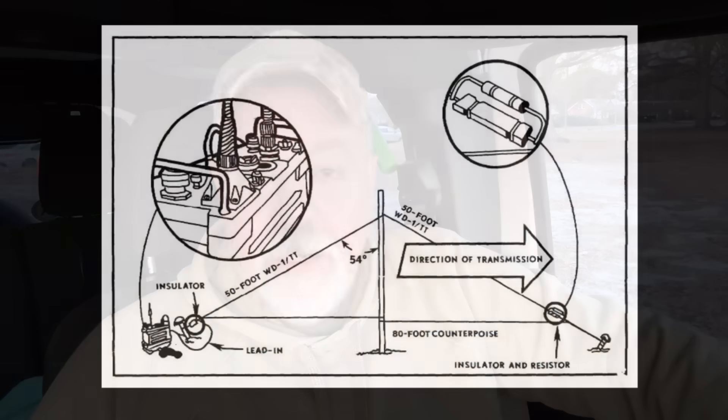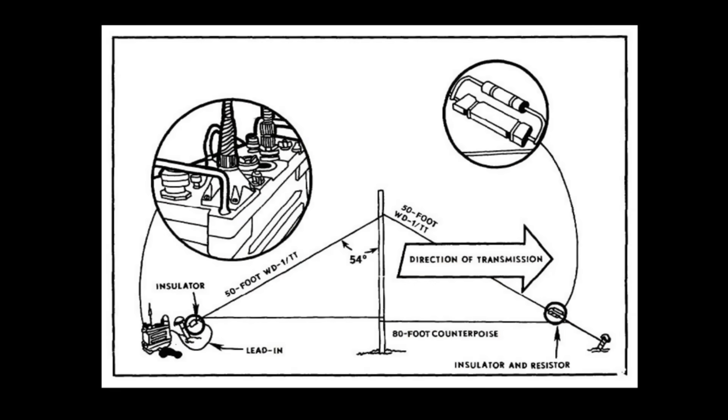Today I'm going to build an antenna. It's a very common antenna in just about every U.S. military antenna book, antenna handbook, antenna build book — you name it, it's in all of them. It's the TEFV antenna — the Terminated Folded V antenna. This antenna is basically an inverted V that's end-fed, but we're going to use a terminating resistor at one end to make it directional.